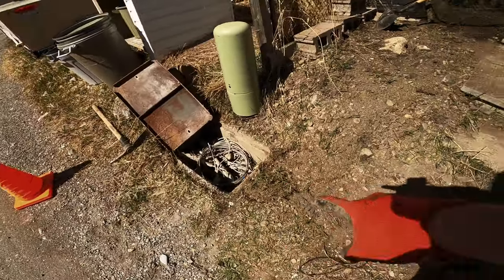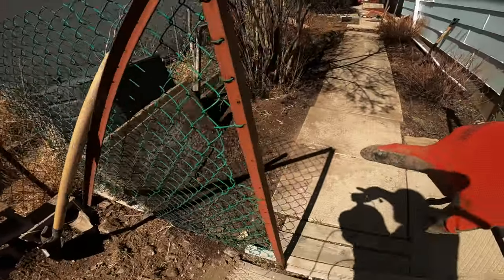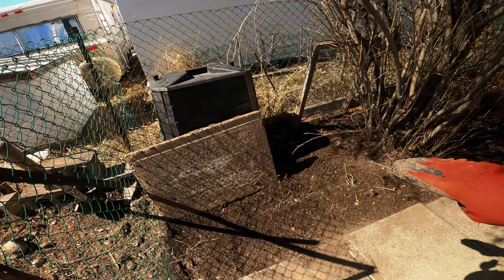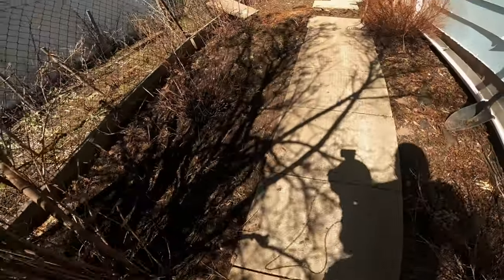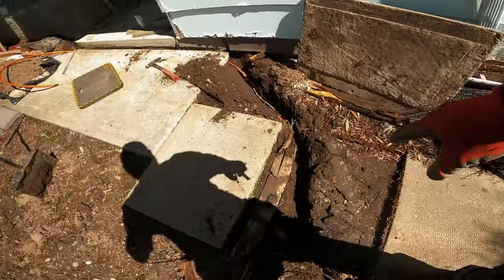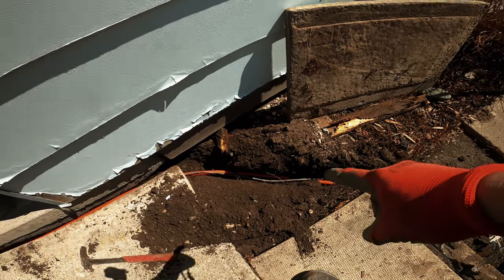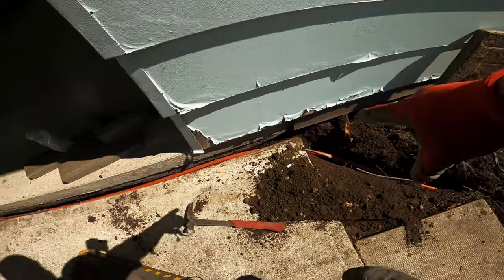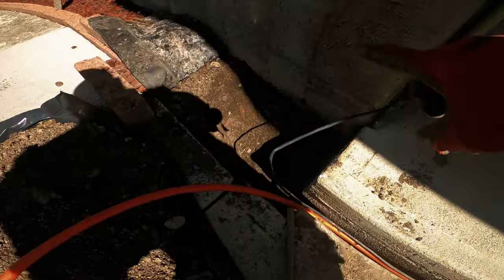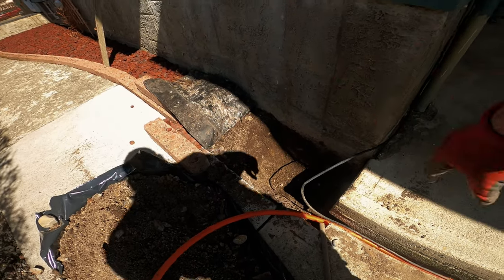We have it all buried up to here - buried tape put in, conduit, a layer of dirt, then the tape all across here. We have to go under these pavers and there is a directly buried copper line that we're just going to feed back into our trench. We dug this down for the sunblock and the concrete pad here, and we're almost to the end where we're going to put a 90-degree elbow and a standpipe.